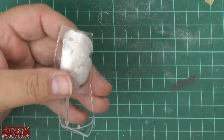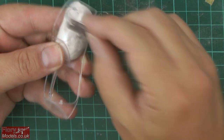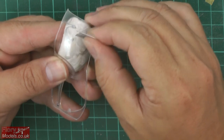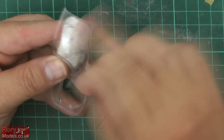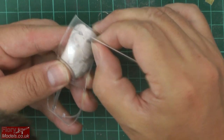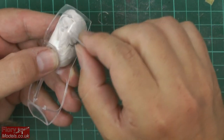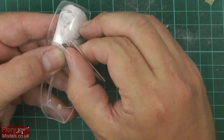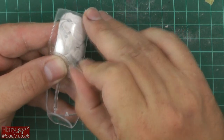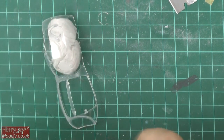This line running down here in the light has got to go. There are a couple of ways to start with because it's a very heavy one. What we're going to do is scrape it off with a blade because it's on an edge. The nice thing about using a blade is we can get right up to the detail running around the back. What you want to do is take it all off until you can't see the seam anymore. It's quite a tricky shape on this one because it's not just flush — we're going right the way up.